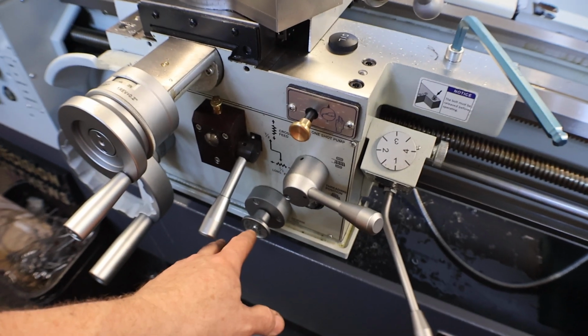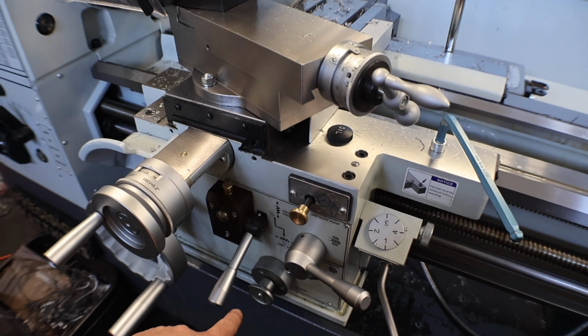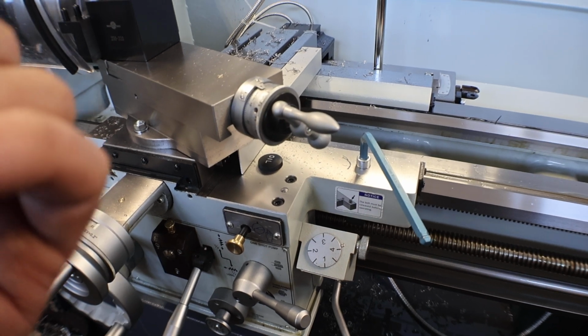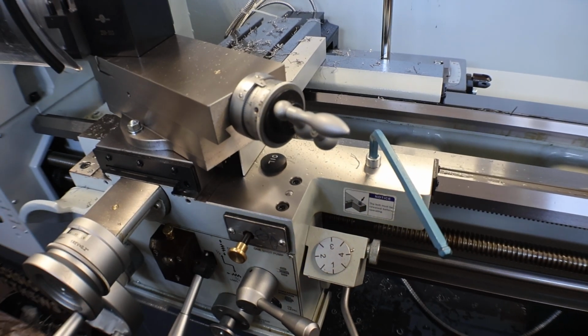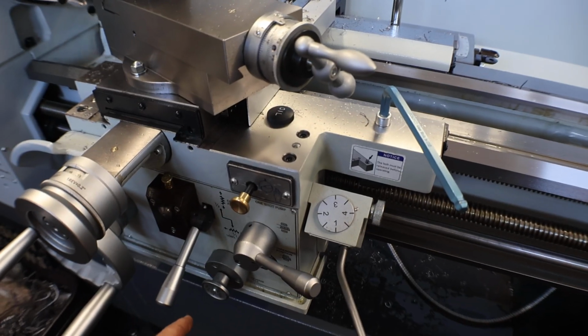It's really nice because once you got everything dialed in and now you're working on the part, you can change your feeds. Like I did some circumferential cuts in X, and then I worked my way, then I backed it out, then I cleaned it up, so I had to change the direction of the feed.